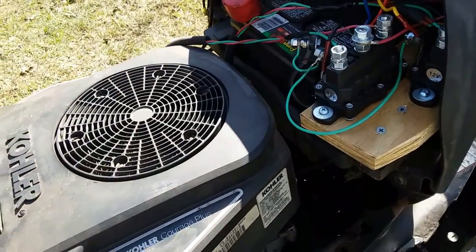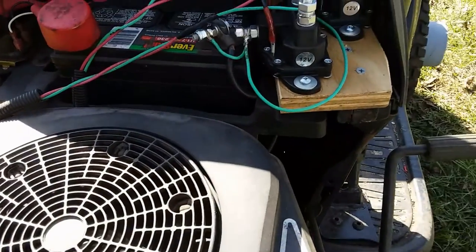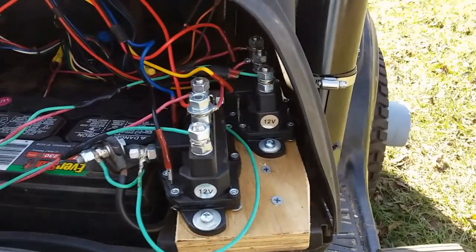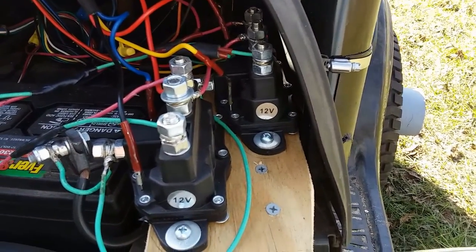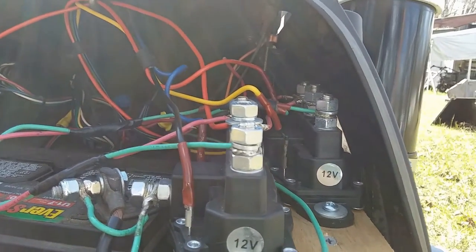And there's the solenoids. These solenoid relays are winch solenoid relays. I use them because you want instantaneous reversal of polarity. The other types of solenoids, such as the automotive type, do not work as well as these do.